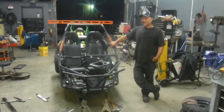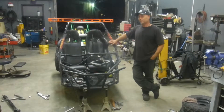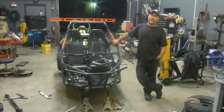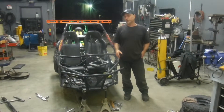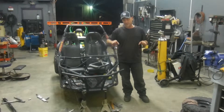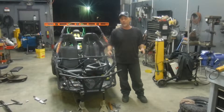We noticed because the first time he had actually had it out at the track, we built a new motor for it. It didn't lack speed, but it handled like hell. It had wicked bumps here. What was odd about it was it didn't toe in — if you squatted down on it, it would toe out. If you lifted up on it, it would toe out.